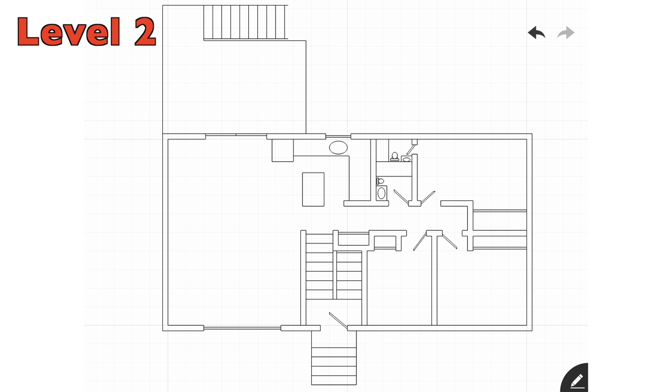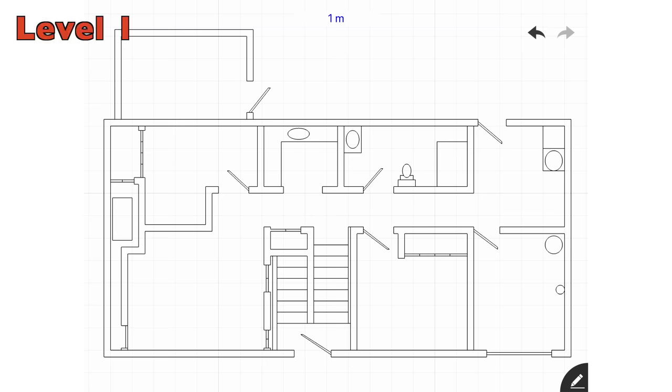So this house is going to entail quite a few devices being installed, which you will see in this video and the following videos, where each bedroom will get a smoke in each corridor, smoke at the top of the stairwell, heat detector in the furnace room, heat detector in the garage, and a heat detector in the shed underneath the deck, as well as two high temperature conventional heat detectors in the attic, which will require a monitor module to be installed. This is going to be running Class B NACs, and I will be installing isolators on the SLC before it goes out to each floor to isolate each floor from each other. So if one goes down and gets shorted, it doesn't take the whole SLC down with it.